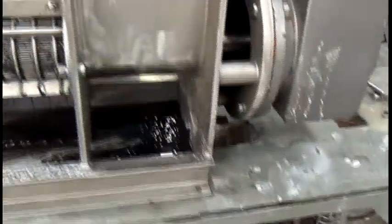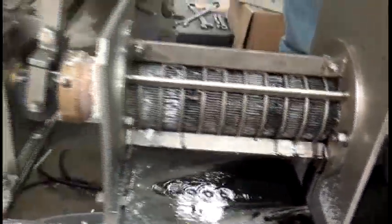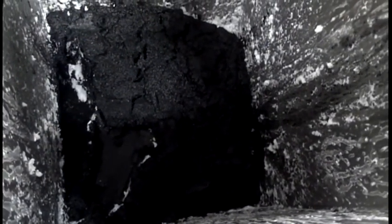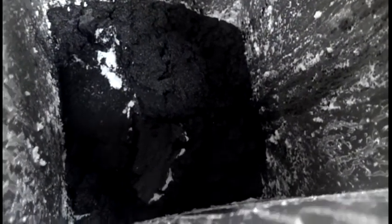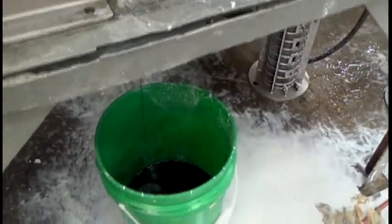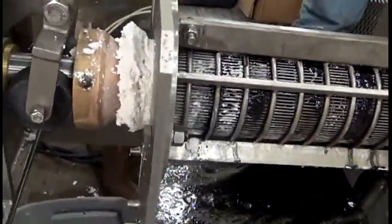Press liquors — that's a good flow of press liquors if it keeps up. That's a little tough to say. The gear is starting to go back towards the gearbox, turning a little bit off. The flow of press liquor has diminished. The stream is not steady — it's a little broken up, and we're not getting any cake out on this side.